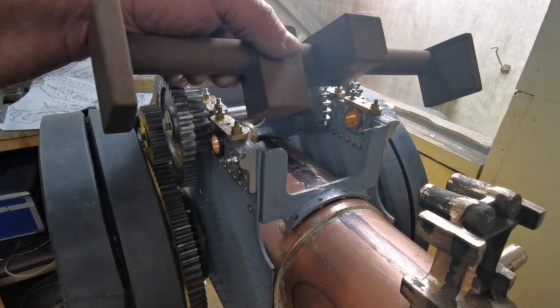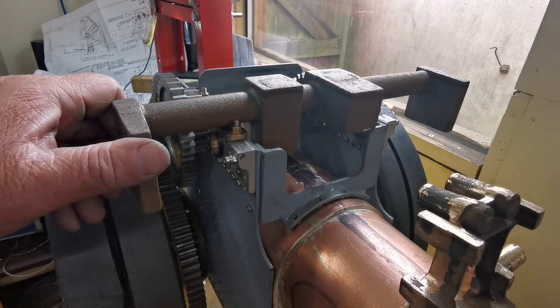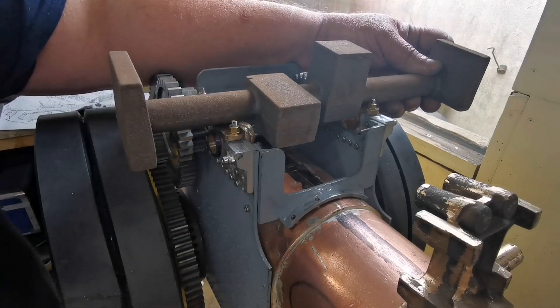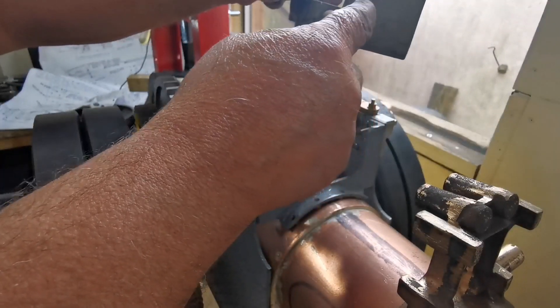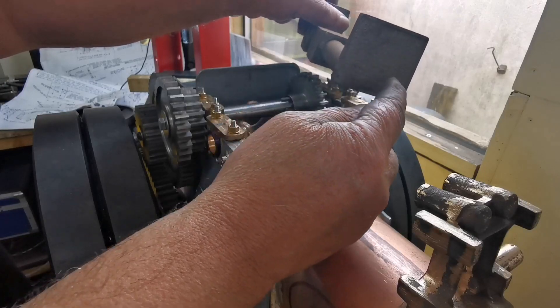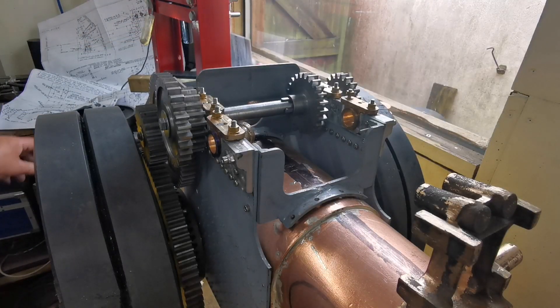In the next video we'll be having a look at the crankshaft — we're going to start marking this out. I've got to have three lots of centres: one centre will be for the main shaft going straight through, then there'll be a centre for this crank and another centre for this crank, all marked out on the end here. So you'll have that centre there, one inch higher a centre for that crank, and one inch over there for that crank. So that's what we'll be doing in the next video. Please subscribe to my channel and join me as I build a two-inch Fowler Showman's traction engine.